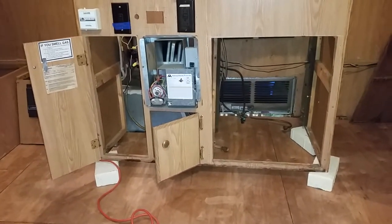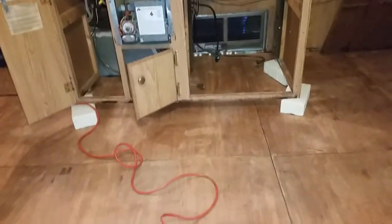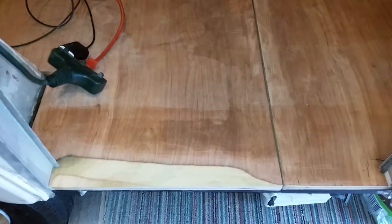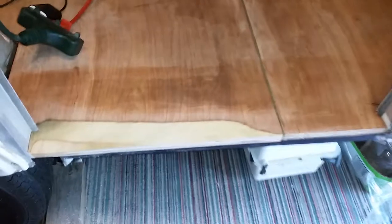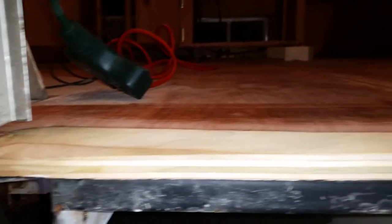Even under the cabinet, I was able to keep it in place and work around it just by lifting it up, rather than having to unhook all the wires and the propane line. All the way to the door here, I did have to sand it down a little bit on the left because the trailer just wasn't sitting completely flush and I couldn't close the door. As you can see, that's the full three-quarter inch plywood, and I brought it down just a little bit — sanded it with a machine, layer by layer, so it's not as noticeable.